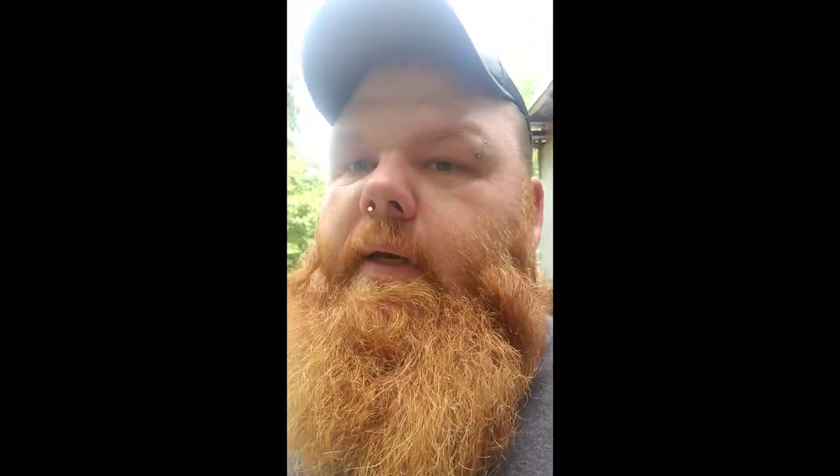This setup will probably run around $200 to $250. If you can weld aluminum it'll be a lot cheaper. I have the ability to weld aluminum, but I didn't have an argon tank — you need 100% argon for welding aluminum — and I didn't want to swap one of my tanks out just to weld two brackets. So I had a local shop make my brackets for $120.